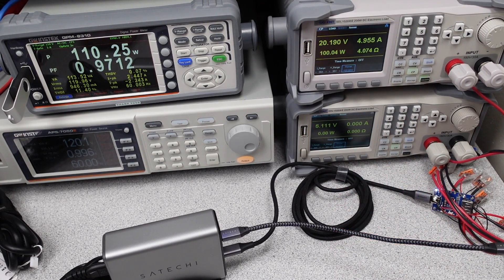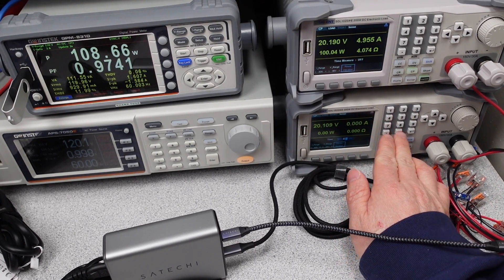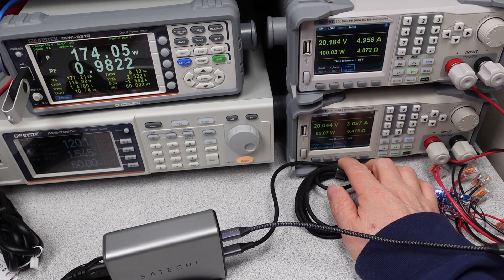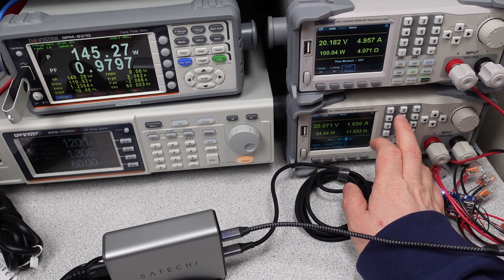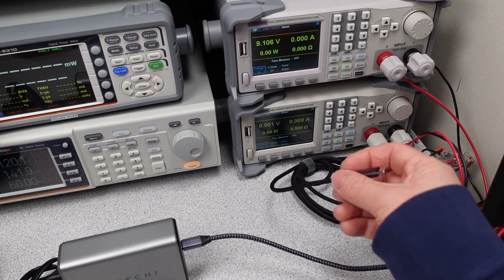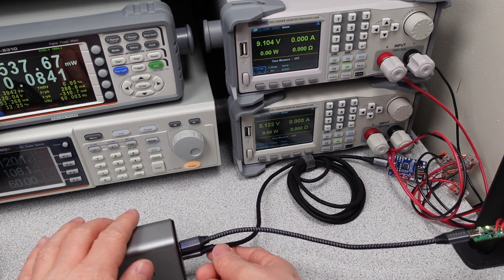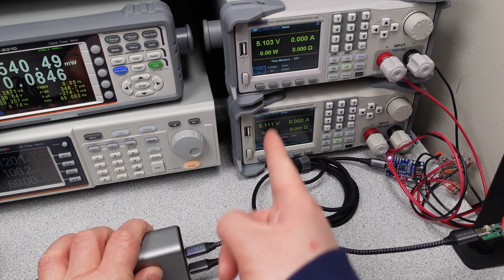This is looking really good. All the way up to 100 watts and the power efficiency is still strong. The limitation of this adapter is that it can only do 100 watts on one port — it doesn't have any extended power range or EPR modes. The voltage levels were excellent; each mode held within the tolerance of the USB specification. This is one of the best I have seen in terms of voltage regulation. The power negotiation is a bit better than usual. It still has to renegotiate after a second device connects: one port at 100 watts, second port at 60 watts — a third port trips renegotiation to lower power levels for those first two ports.